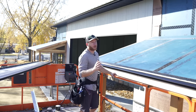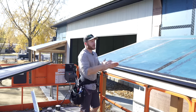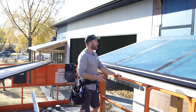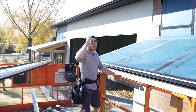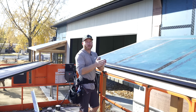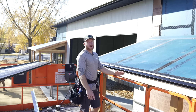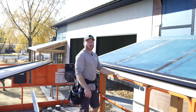The vertical siding from LP is exactly 16 inches. By the time you space it, it does grow a little bit. We could rip it down, but then you have to prime it. That's a huge pain. Maybe LP, if you're watching this, if you're listening, maybe think about the fact that when you space your product, it's going to grow. So incrementally, if you're trying to line up a 16 inch on center vertical siding with studs, you should make it maybe 15, and I guess that would be 13/16.